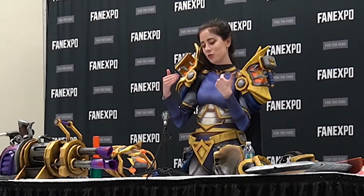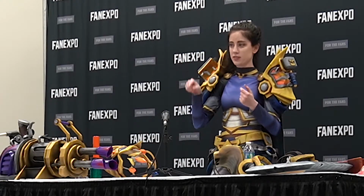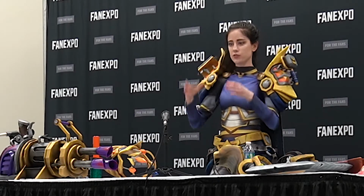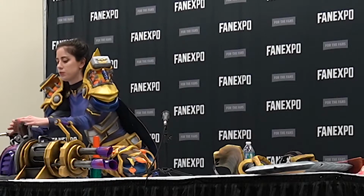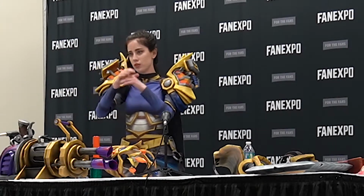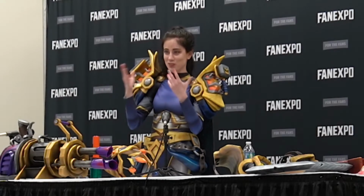For the stair step, unless you're doing a resin printer, a normal 3D printer that's doing your plastics, it's printing, if you picture a staircase, it does the up, down. You're printing basically like that. So this one piece is 3D printed, not the rest of it. But if it's printing in layers upward, and it's going into smaller circles, you're going to get what's called stair stepping.